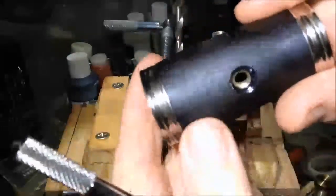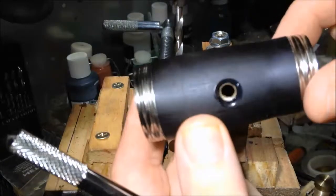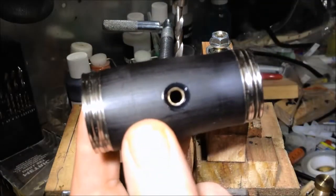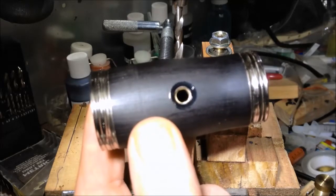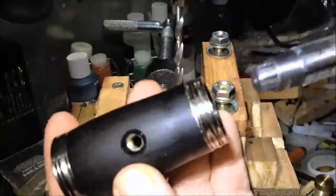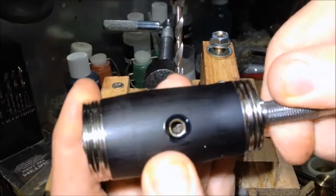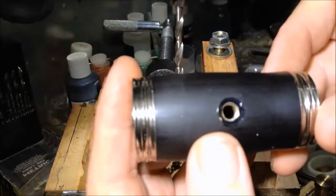The shiny surface there makes a good seal. The O-ring will fit into that sort of conical shape left by the meniscus. And that's it. Ready now to get the piezo barrel. Next step is just to tidy up inside the barrel if I need to with this reamer. Just run that through and just clean off any little bits hanging out on the inside of the barrel.